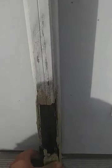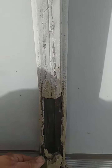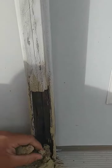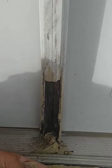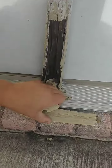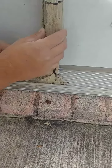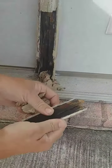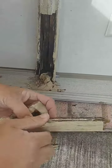This right here is wood filler — wood putty — and it gets very, very brittle. It is not designed for external use. It has all kinds of additives, but it's not designed for external use. So what they did, they tried to patch it. You see where they used wood putty for the whole thing? It gets really brittle, kind of like liquid nail. So there's no barrier there.